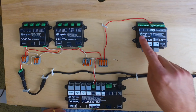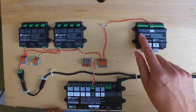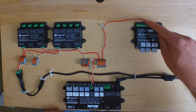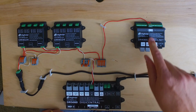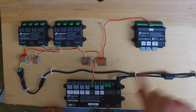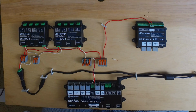And so the way this works is that when there's a voltage drop or a detection, like a locomotive or a car with lights goes into that section, it detects the voltage drop and then relays it back to the computer, and then it tells the computer, hey, there's something in that section. So then it marks that track as occupied.